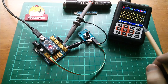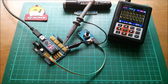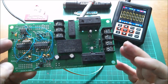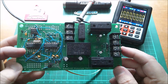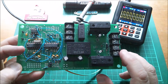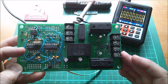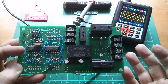In the documentation it's described as 976 hertz, so it's not far off one kilohertz. For my EVSE — my electric vehicle charger — I actually need one kilohertz, but there is a tolerance: 980 to 1020 hertz. And 977 as measured, or 976 more precisely, is just slightly under the lower bound of the tolerance. A car charger requires no less than 980 hertz, so we're four hertz below. We really want to tweak the frequency to get it up to exactly one kilohertz.